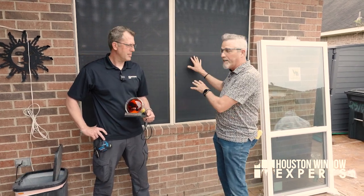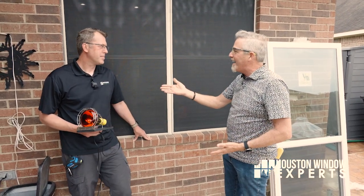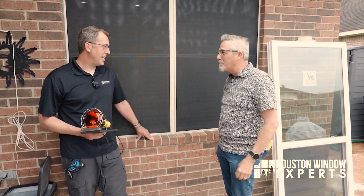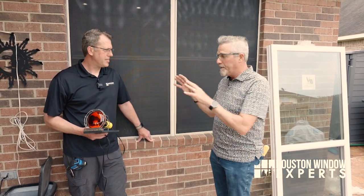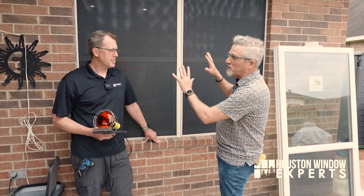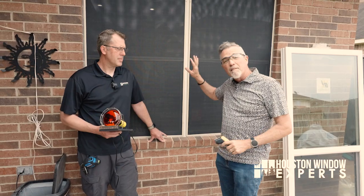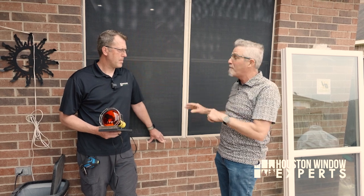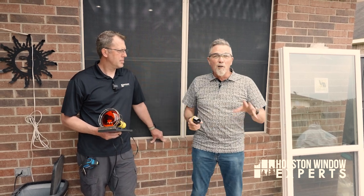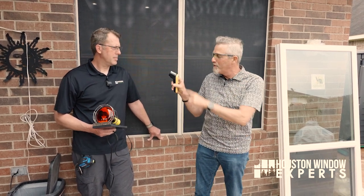People ask: when I buy new windows, am I going to reuse my solar screens? Didn't your dad do solar screens for a long time? We did, yeah, a very long time. And do they work? They do work, they really do work. So today we're going to show you with this heat lamp — which creates a lot of heat — how well solar screens work by testing the temperature on the inside with a digital thermometer. Then we'll remove the screen and see how the window performed before, and compare it to a new high-energy-efficient double pane window to see whether you'd still need solar screens.